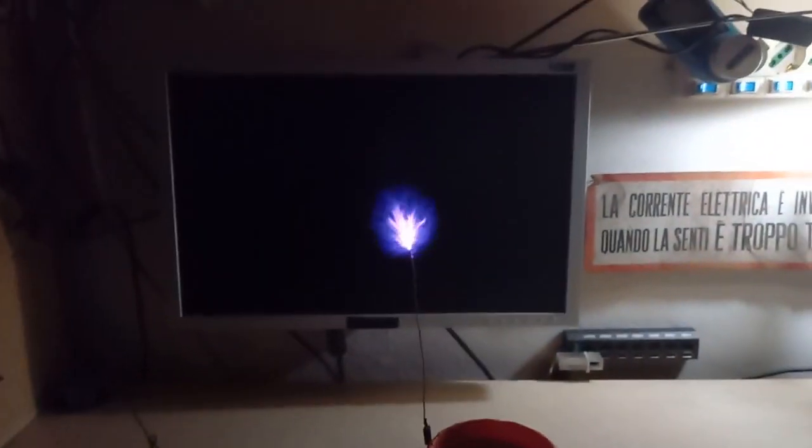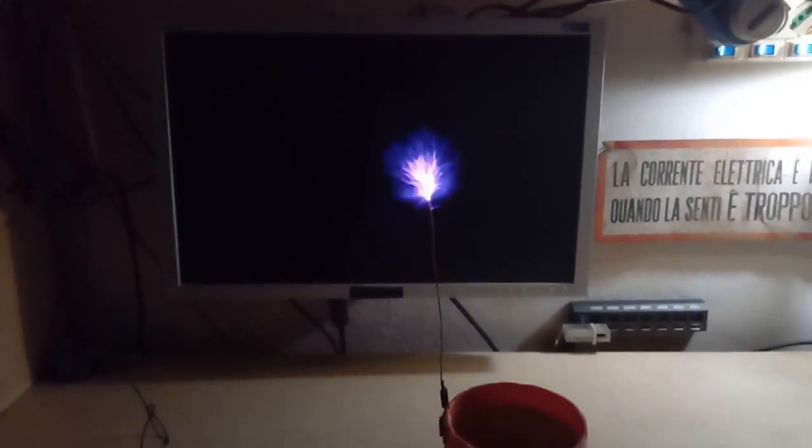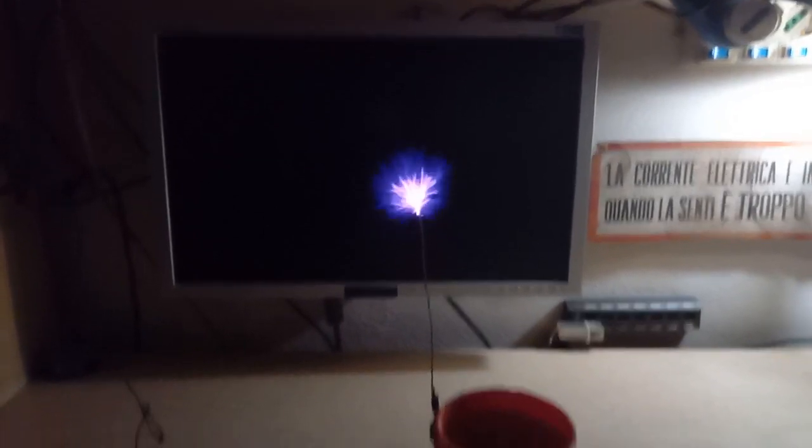Let's try it — power on. This is the result. We are at more than 5 amps, around 19-20 volts, limited by the current. Let's turn it off because the primary heats up and it's stuck with hot glue. Ha, I'm a genius.